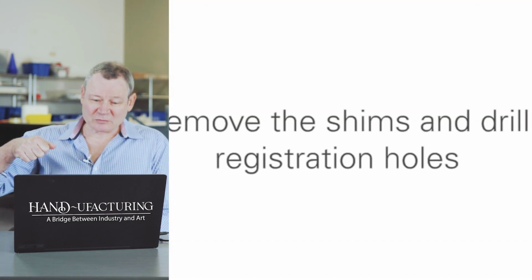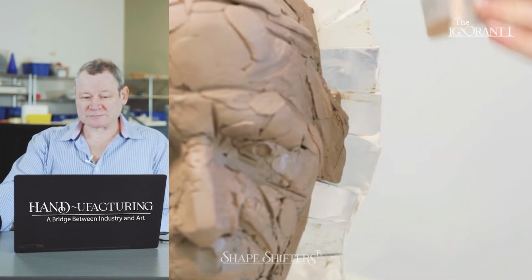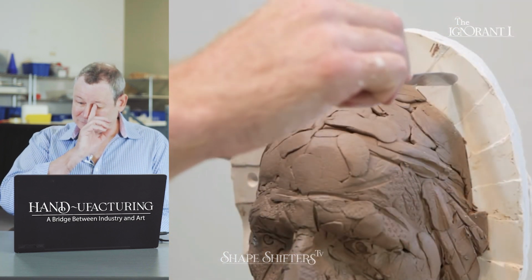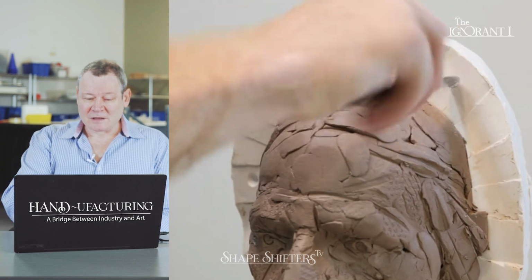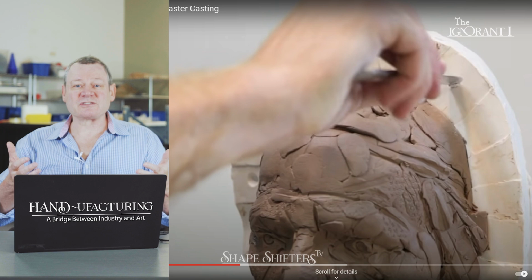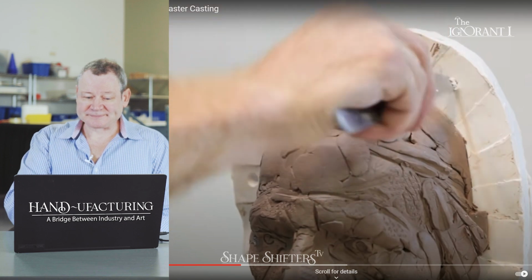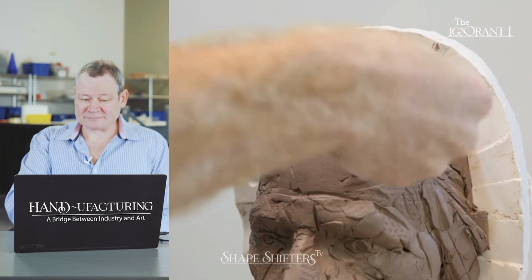You just take some needle nose pliers and you pull out the shims and you clean up the clay. You remove the shims, sliding them out carefully so that you don't affect the original clay sculpture. You want to carve out some registration holes with a sharp tool, a knife or a chisel. So the way the shims create the stepping effect is actually registration enough. The mold keys, it's just an added perk, you don't really need them. So that the two halves of the mold will lock into place nicely when they're put back together.